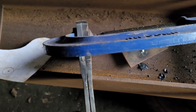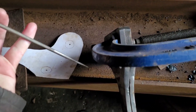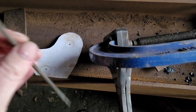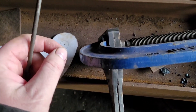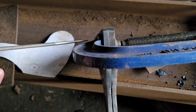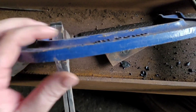I plasma cut these. What I did was use a template and draw around it with a sharpened chainsaw file as a scribe. It was hard to see so I used a permanent marker and colored inside the lines so I could see to cut around it — because paper would just go on fire.